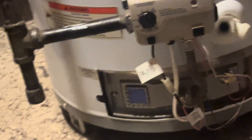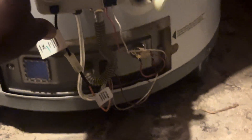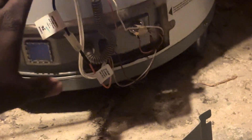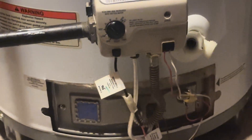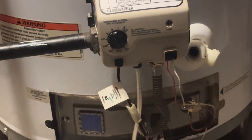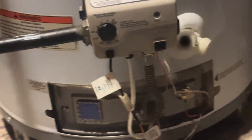If the status light is not on, you'll have to keep holding the switch in and keep pushing the ignition button, waiting about 15 seconds each time. What you'll notice is the gas will fill up inside and there will be small bursts of flame as you're igniting small amounts of gas, until the unit actually ignites and runs self-sustained.